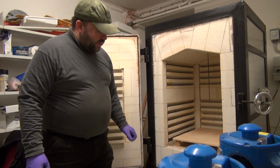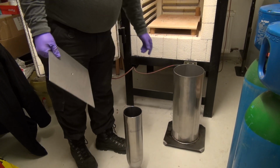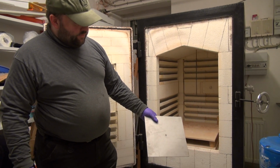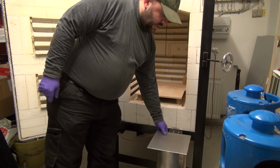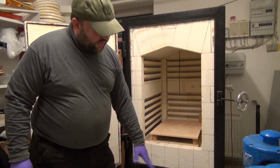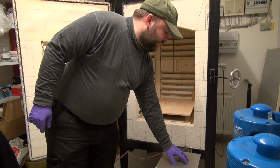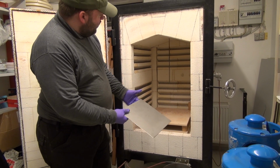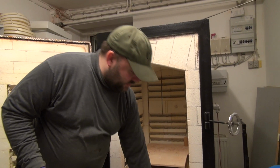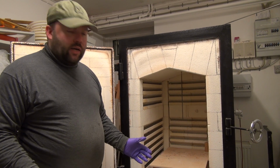So today we manufactured a very special, rather big thing here. This is basically what we're calling the gas chamber. This plate fits on top of this one, and then this cylinder is basically gas-proof, leak-proof. The only way gas can come in and out of this one is either through this little hole or some very small cracks beneath this lid. This little hole fits quite well with the pipe we have in here. So half of the things we're going to put into the oven today are going to be inside this gas chamber, which will be guaranteed to be completely flooded with inert argon.